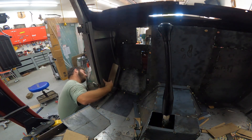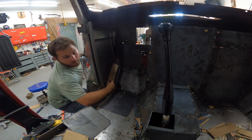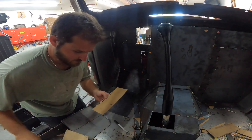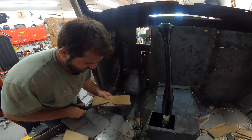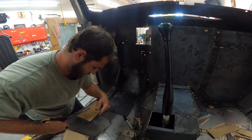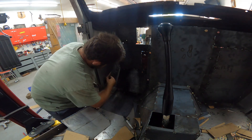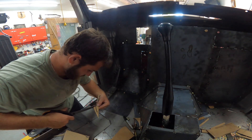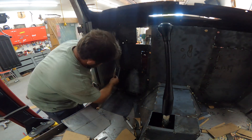If I can even reach this side... I can barely get it. Okay, I can't really get it that good but that little piece — I'm gonna cut it a little bigger. We'll go little by little until we get the proper size. I always run out of cardboard — always run out. The stuff doesn't have to be dead on; you are welding it, you can fill tiny gaps. You don't want too big of gaps but you can fill small ones. That looks pretty good, just a little bit less right there.